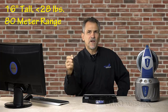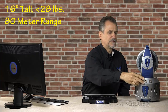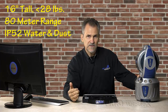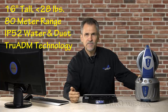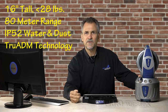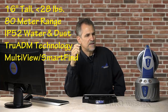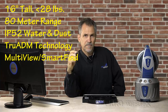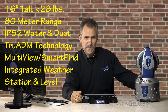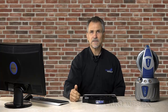The tracker has a measuring volume of 160 meters, or 80 meters in any direction. An IP52 water and dust rating allows it to operate in a wide range of conditions. FARO's true ADM technology improves dynamic accuracy and eliminates the need for interferometry in most applications. The multi-view camera system efficiently locates targets and enables Smart Find for rapid beam pickup. Finally, the tracker offers integrated solutions such as a weather station and a precision level. These are just some of the highlights of the FARO hardware. Next, we'll take a look at the software.